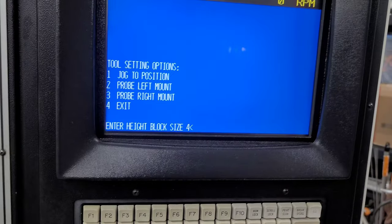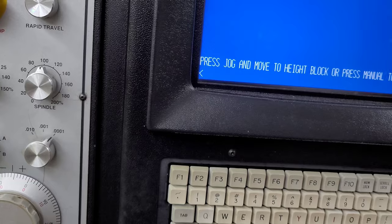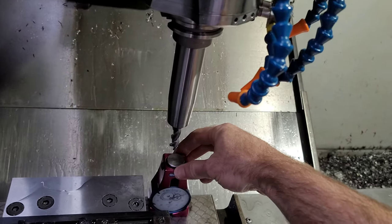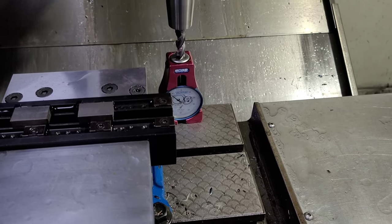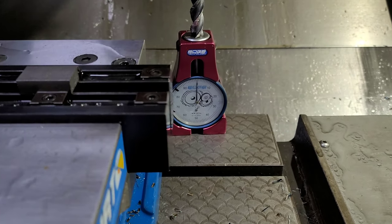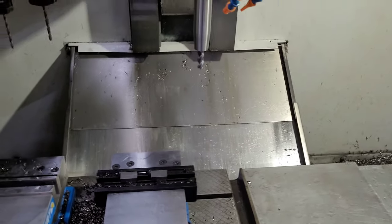The block height size being your tool height gauge. That one's loaded — go to Locate Length. Obviously you'll do this faster once you get good at it. Make sure that's in the right spot. You can do these sequentially and measure all your tools in your carousel this way at once if you want. Go ahead and set that zero. Manual go back, and that part's done.